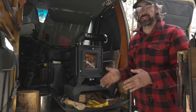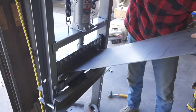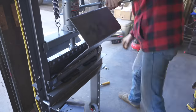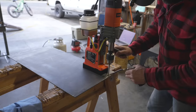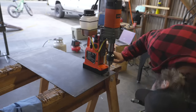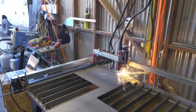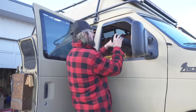The plasma table made the rest of the process a lot easier — I could just send parts to it and it cut them perfectly. I then used my finger brake from Swag Off Road to bend the shape of the box into a C-channel, with one-inch tabs coming around the bottom that I used to mount down to the main base plate. I used the mag drill again to drill the holes into the box and into the main base plate. Then I used the plasma table to cut out the face plate and rear plate and welded everything together.